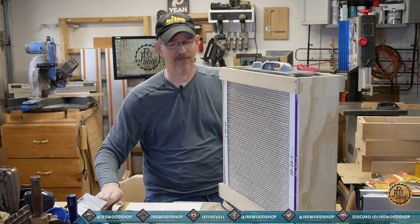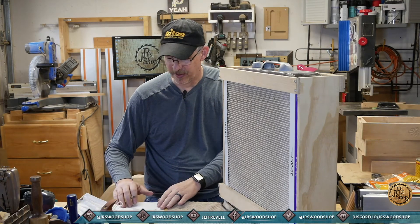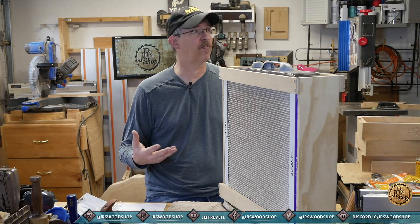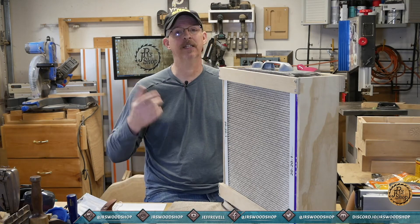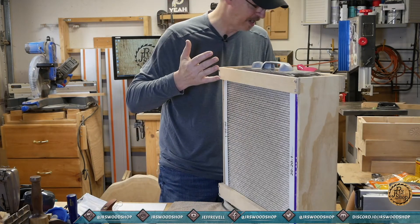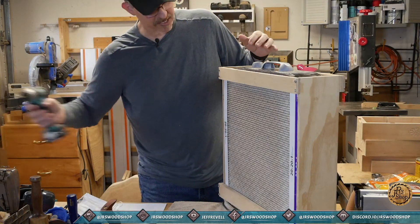Let me break this down for you. I'll link the article — go compare the things and look at the writeup. If you're a budget-minded person who needs to clean dust out of the air, I've got a 4,000 cubic-foot shop — 20 by 20 with a 10-foot ceiling — and I can turn over a lot of air with this thing, get a lot of particulate out of the air, and breathe easier. So let me show you how this is constructed because I need to change the filter.